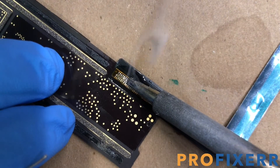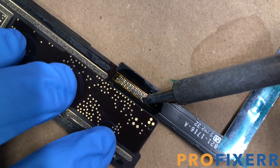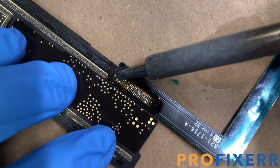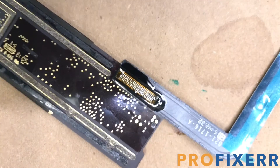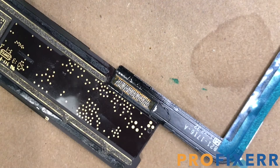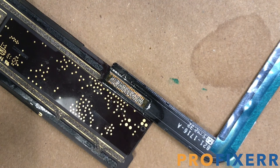The way you're doing this is you have your soldering iron that you've added solder to, and then you're just going to lightly drag it down all of those solder pads. Since you have a little bit of solder on the logic board that we added earlier, there are little tiny holes in the flex cable that allow solder to pass through. What you want to have happen is that the solder from beneath actually reaches up to the solder on top and vice versa, so that they become one piece. Move the soldering iron in line with each of those soldering pads, making sure that none of them are bridged. If they're bridged, then de-bridge them. As you can see here, it's pretty straight. Hopefully this helped you out and you can have a successful iPad Air 1 charge port replacement. Subscribe to our channel for more videos and stay tuned — have a great one.